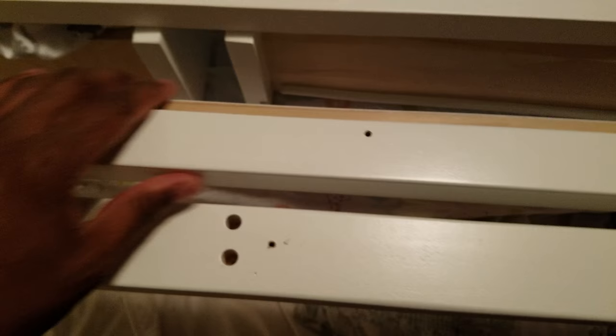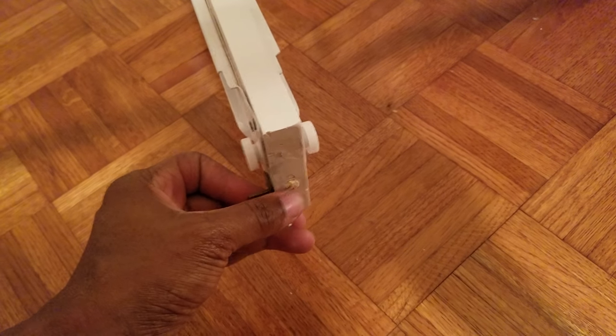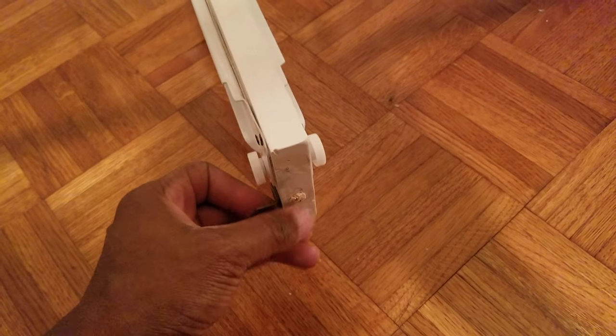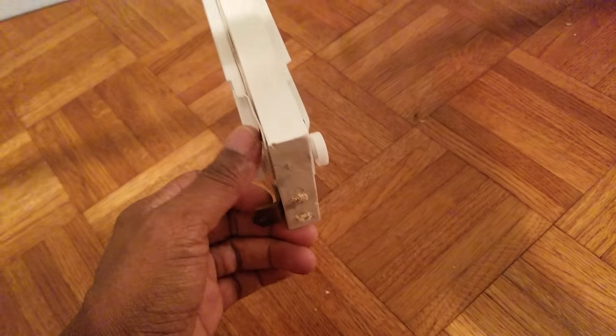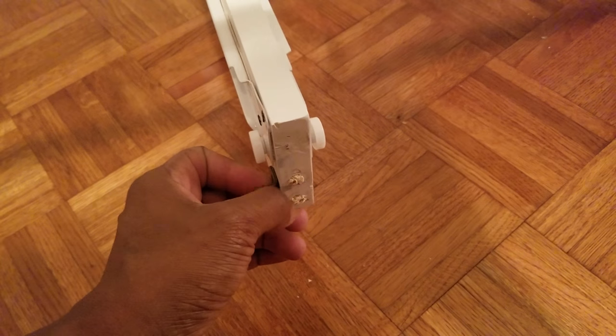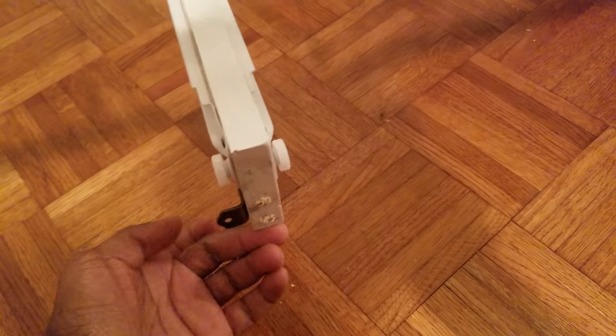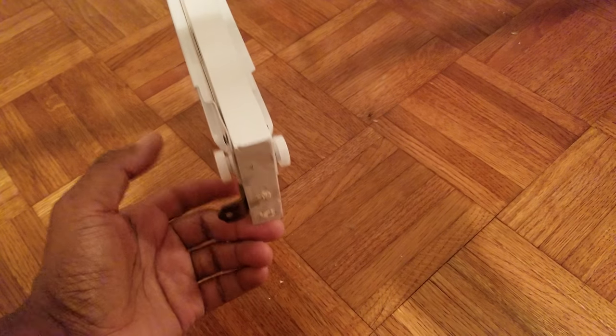To keep the drawers, there are usually two wooden guide pegs — just knock those off. They don't come out easily because if you've been using the crib for a couple of months to a year, they expand from moisture and get stuck. So I just sawed them off. I'm going to keep the base because that's what's going to anchor the drawer rail to the crib.